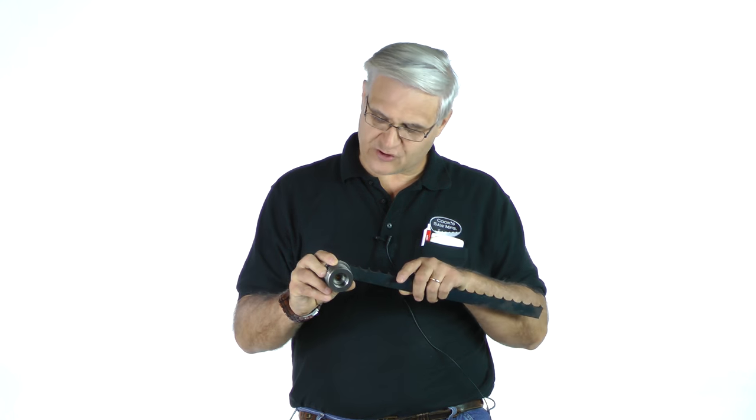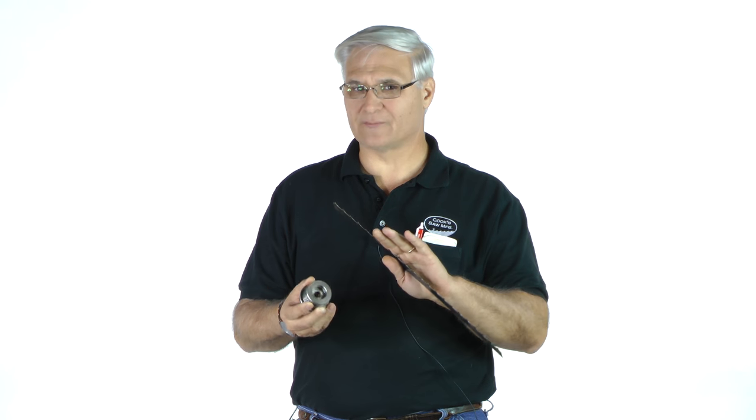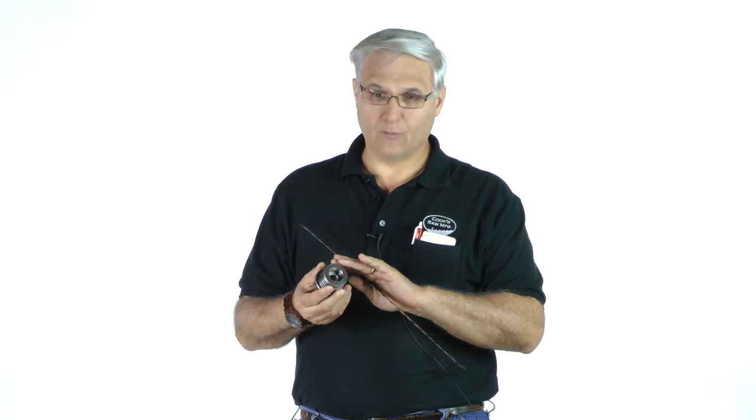Another thing to know is if that roller guide gets stopped, a piece of bark or something jams in behind it, or however that can happen, you haven't greased it enough and it stalls, it doesn't take but 20 or 30 seconds, and that will put a flat spot on your roller guide, almost like you ground it. It is amazing. Even though it's hard, it will do that very quickly. High friction there.